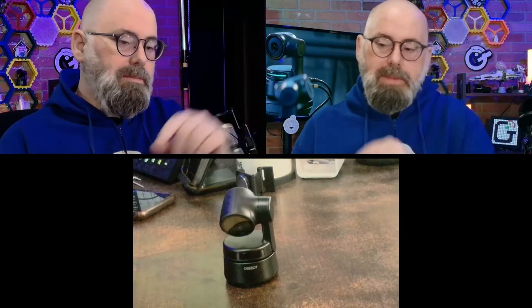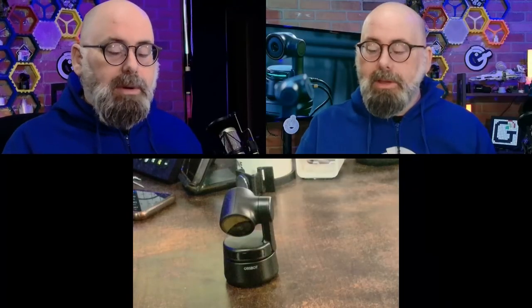One thing I want you to hear is the audio from this camera — the main camera through Wirecast with no post-production audio processing at all. The cool thing about Wirecast is I can switch between cameras and keep the exact same audio. This camera is about two and a half feet away from me. A more controlled room helps; if you have a lot of bounce or room noise the audio will be worse. You might hear some computer fan noise since the camera is right above the computer, but this is how it looks and sounds with the built-in microphones.